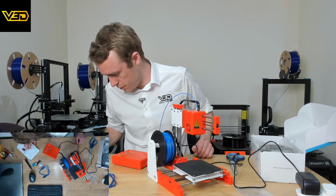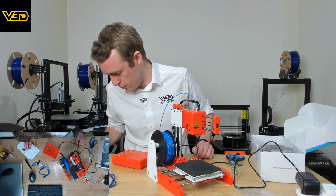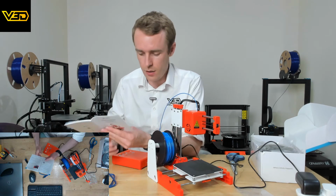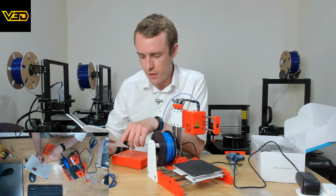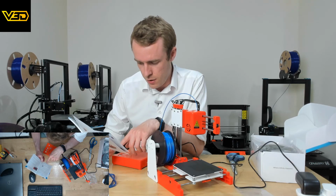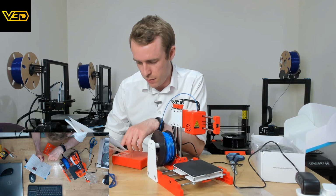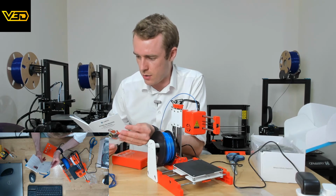For the first time to use this printer, you will need to level the platform. Please adjust the distance between the nozzle and the platform in 1, 2, 3, 4 points. The nozzle height above the platform should be 0.1 millimeters, which is the thickness of a sheet of A4 paper. Click the button Home, Z-axis. I can't even read it now, because it has these symbols which match this, but I'm trying to say home when it's a picture of a home. Z-axis will move to the home position. Move the nozzle to 0.1. Put a sheet of paper between the nozzle and the print platform. If the distance is too far, please turn the hand-twisted nut counterclockwise to make the print platform rise to the standard distance. If the distance between the nozzle and the platform is too close, please check the distance is right.